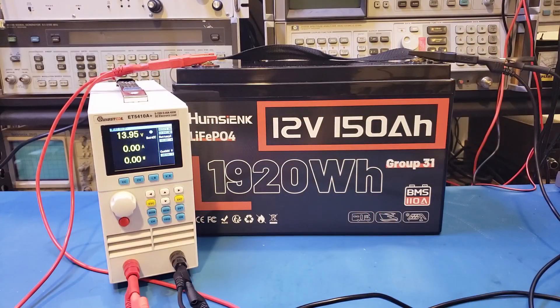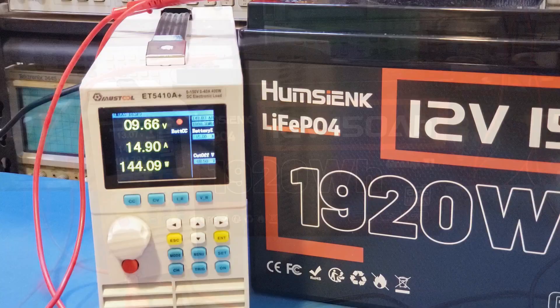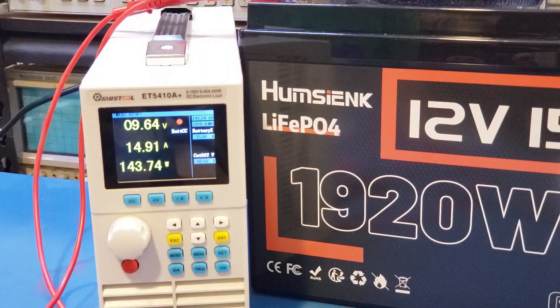To test the battery capacity, I chose the standard 0.1C discharge rate using my electronic load's battery testing feature. Unlike some other battery chemistries, LFP batteries' capacities are fairly constant regardless of the discharge rate, and I use the 0.1C just for convenience. Their voltage curve during discharge is also fairly flat — the battery terminal voltage does not drop significantly during the discharge cycle until the very end. You can ignore the voltage measured by the electronic load, as there is some voltage drop across the wiring. I was able to capture the last few seconds of the discharging cycle on camera, and you can see how rapidly the voltage drops towards the end.